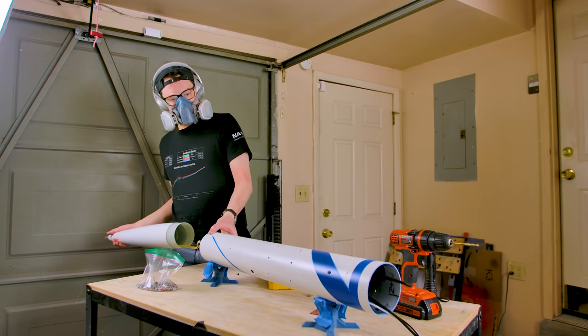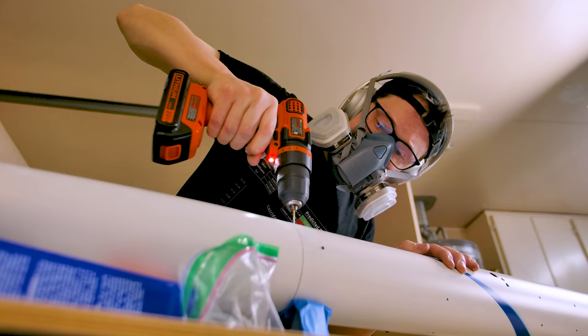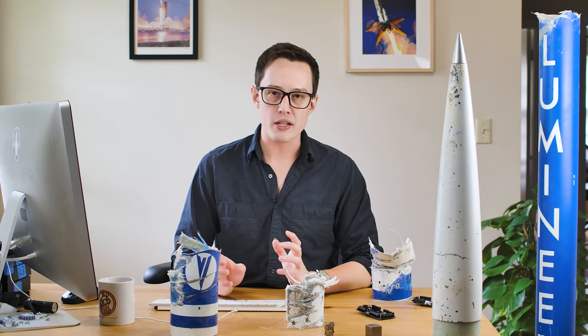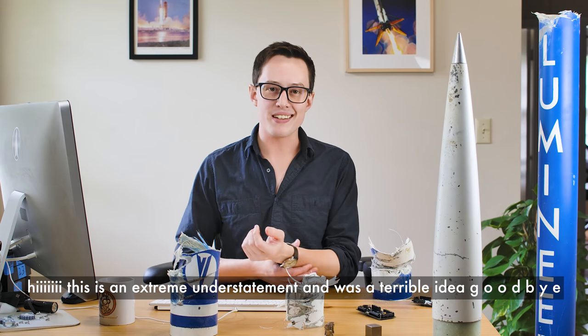Along the way I also drilled vent holes in the nose cone, holes for the shear pins to break on drogue deployment, and made a few small adjustments here and there. All of this was built on an incredibly compressed schedule — I built most of Lumineer in the better part of a month and change. That's way too fast, and I got away with it, sort of, but it shouldn't have happened this fast. The whole point of Lumineer was to teach me what I'm thinking about wrong or making incorrect assumptions about in high-powered rocketry, and boy, did I learn a lot. There is so much to consider in how you build one of these things that is just hard to know before you build one — so maybe setting the launch date before starting the build wasn't a great idea.